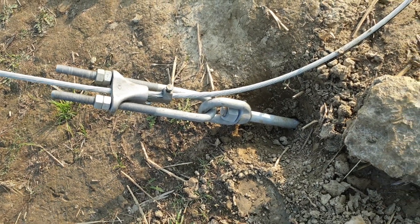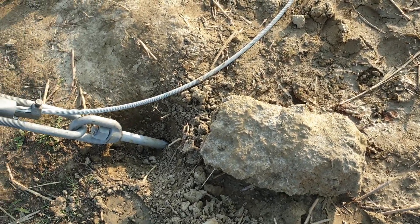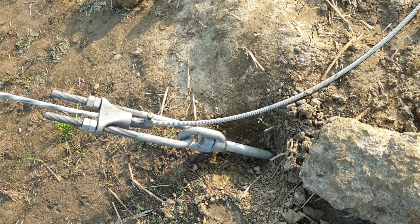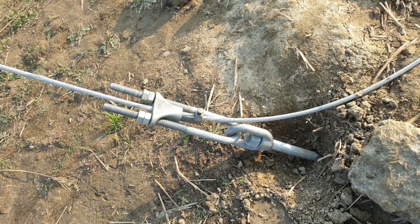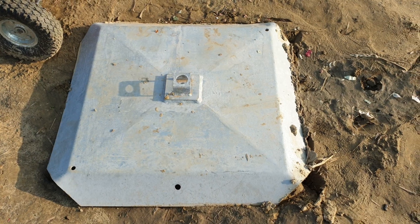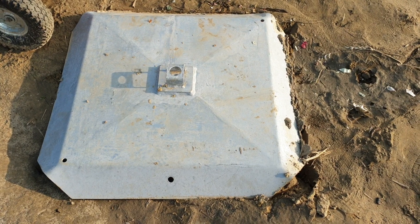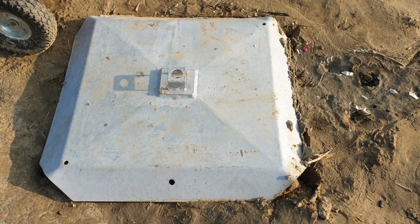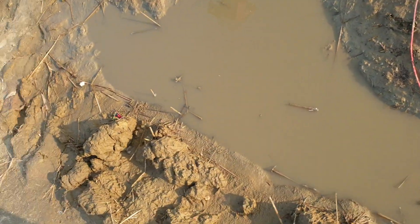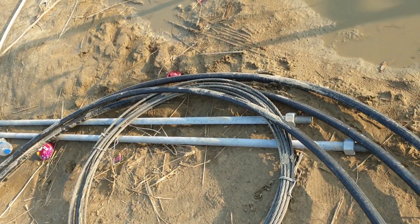Now let me explain a few more things about the connection of the guy wires. The guy wires will be connected such that about 2 meters of digging is done inside the ground and a plate will be placed inside. This plate is connected to the mast section using universal brackets. The plate is placed inside the pit and locked using a rod through this hole — the rod connects with the plate inside the pit.